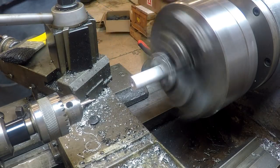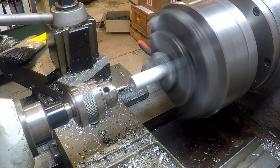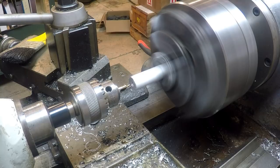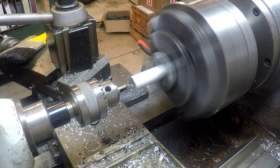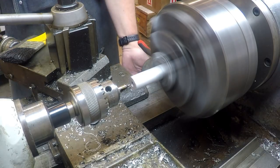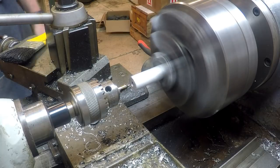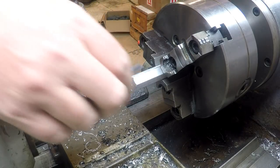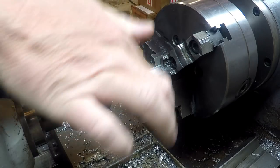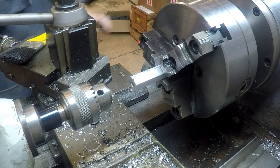We're still in direct drive. We're going to roll up here and get a little A-bomb approved lube, and just touch off on this chintzy bolt. There we go. That's about that. I'm slowing it down to about 1,000 RPM before I drop the drill bit in here. I'm going to pull the center drill back out. That's the last time you'll see that offensive little monster in this video.